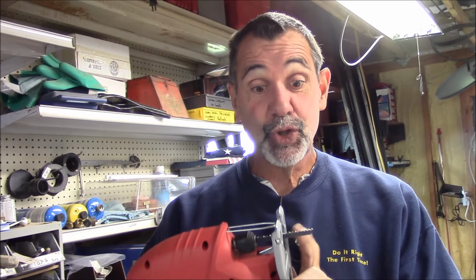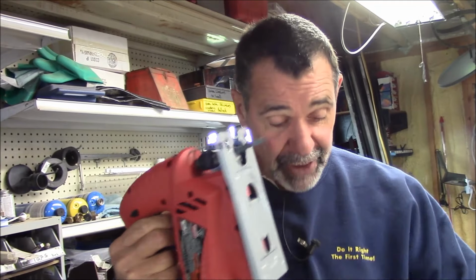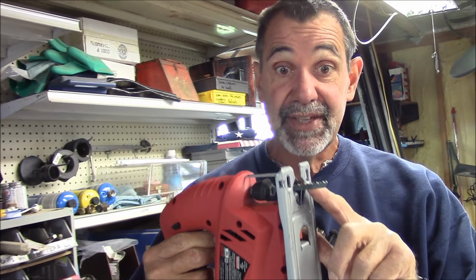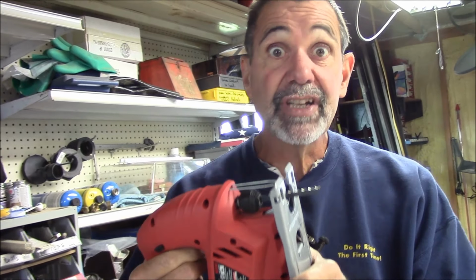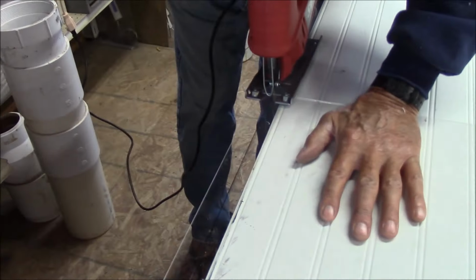Okay, it broke. The 6-tooth per inch jigsaw blade. Now you gotta be careful, you have to keep the blade near the edge of the countertop when you're cutting the material, but you'll see that this will get the cut done. As long as I don't let the plexiglass chatter, it's going to give me a little nicer cut without as much meltage going on.